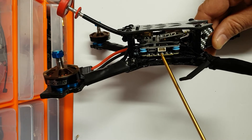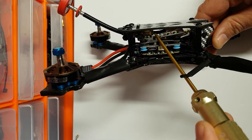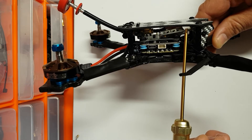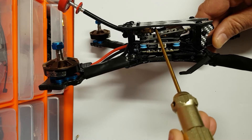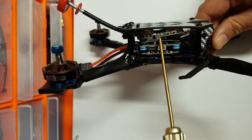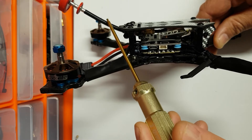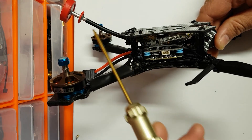I've used a little fiberglass plate, and the reason I've put that there is I'm using the Matek VTX. At the moment this is running the Matek pigtail, which is annoyingly long. I needed to move the Matek board a little bit further forward than I originally wanted to, until I get another antenna. I've just run the pigtail along here, zip-tied it on top. At the back I've got a full-size Emax pagoda antenna. I'm going to replace the pigtail and antenna with either the Lumenier Axi antenna or the Demon RC V antenna.